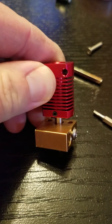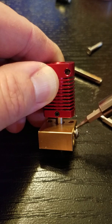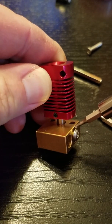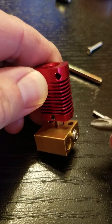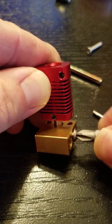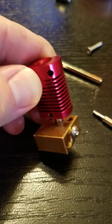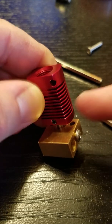That's actually tight against the top of that grub screw and there's plenty of clearance there for the wire for the thermistor without pinching or cutting. There's tension on the threads so this will retain in the heat block no problem at all. It won't fall out and you can be sure that you have positive retention of your thermistor as well.